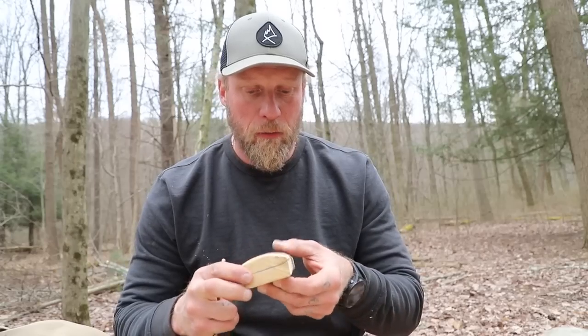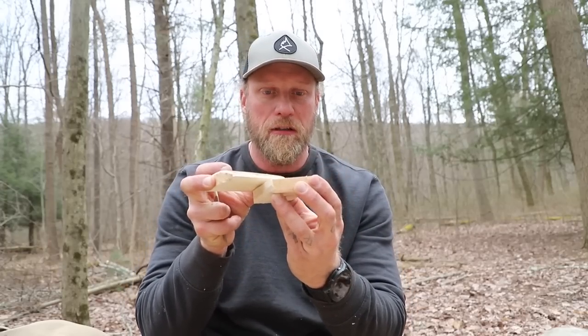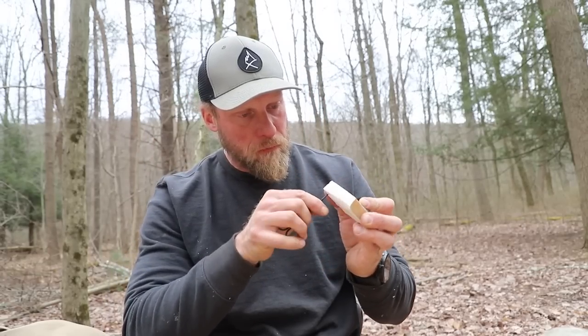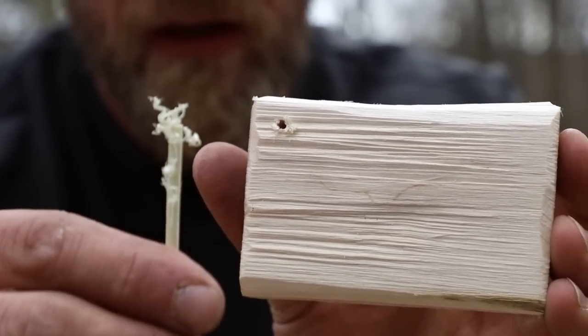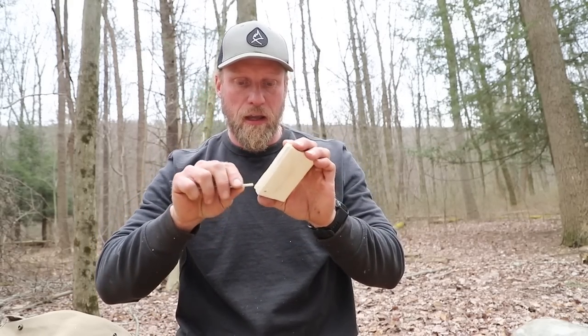For the stick itself, I'm going to use a gimlet - you can also use an awl or a little drill. What I can tell you is the wood is higher on the bottom piece on one side than the other, so I'm going to have it swing away from the high piece. That way when you swing it into the high piece, it's really not going to want to go much further because it just binds on itself. So I'm going to drill out this back corner. You can see our hole right there is drilled. Now I have to insert my stick - you can see all these little curly cues on the stick. In nature you're not going to find an exact size stick, so get something close, use the back of your blade and make scrapings until you get it small enough to slide in. You don't want it so tight that you crack your wood, but you don't want it so loose that it's falling out. It's a slow process, but if you're out carving something like this, you'll probably have the day to yourself and you're just enjoying being out here.